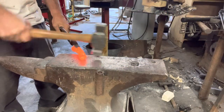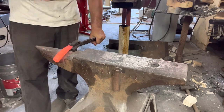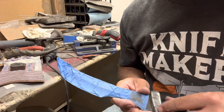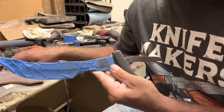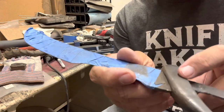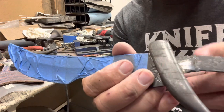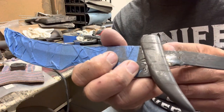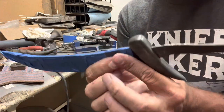After I quench it and put the knife in the temper for a couple hours, I begin working on the guard — using a hammer to get the rough shape and then grinding to final shape. It's been about three weeks since that point in the video. I've had to cut quite a bit of the video because it was getting long and I still had a lot to show. I've heat treated and etched the guard — you can see the twist pattern — but the steel I used wasn't dissimilar enough. I used some saw blade and band saw blade and they just didn't etch differently, so they must have been similar steels. I'm going to coffee etch it so it'll be dark; I still think it's going to be a good look.